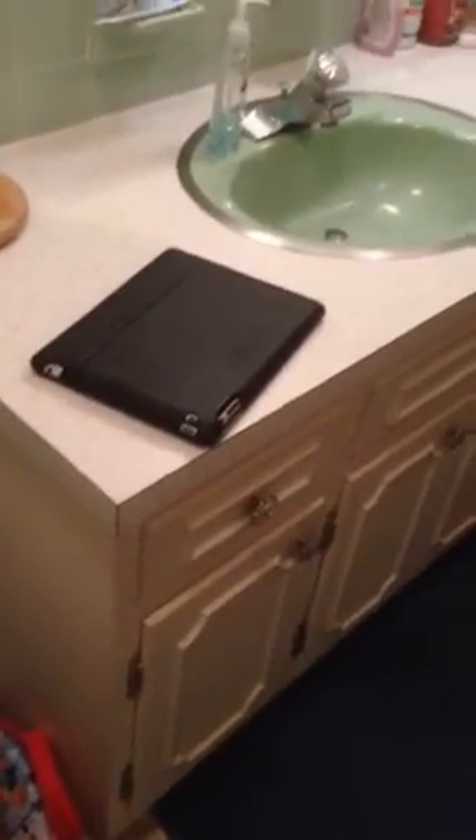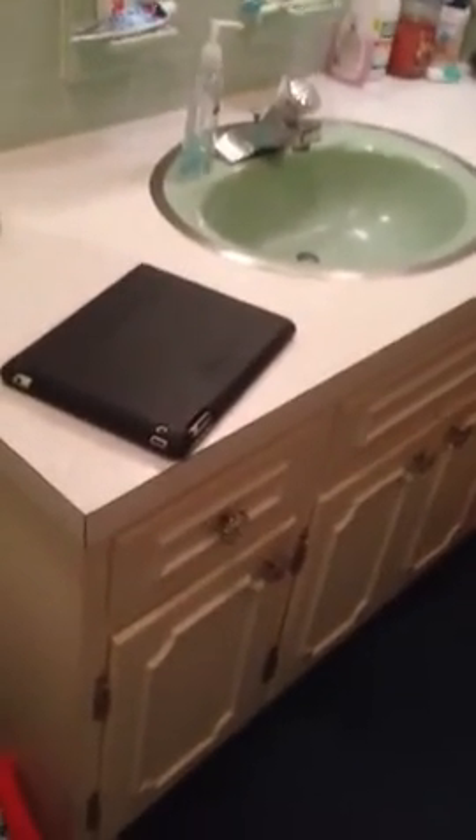As far as the vanity — the vanity top is going to go, the vanity is going to stay. I can't tell whether this tile is cut around it or whether the tile on the wall has the vanity in front of it, so we really won't know what's going on until we get here. I hate to have to take that vanity out because of the age of it, but we might need to because of the tile behind it. You might be able to cut it out around there — I'm not sure. Basically wherever there is tile, I need you to get the drywall ready to be painted.